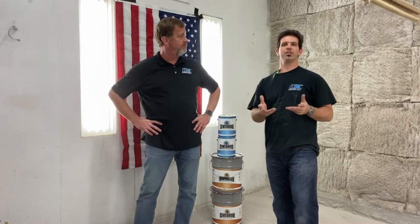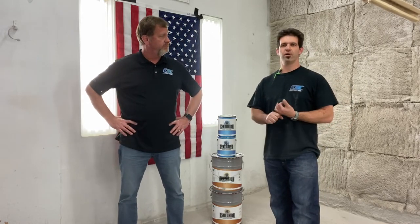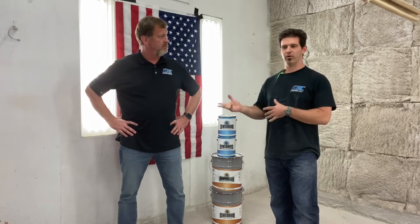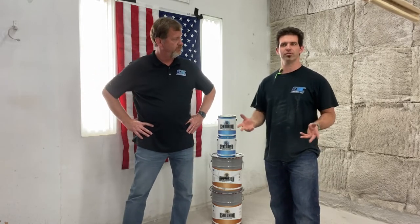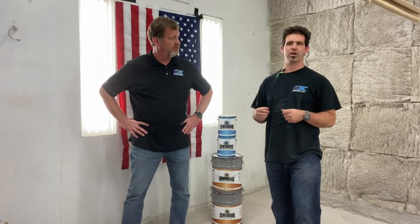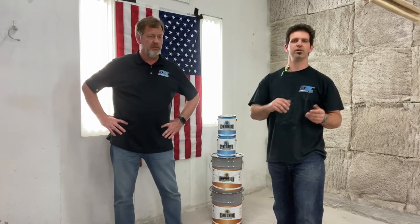Yeah, so a couple things I want to point out that we did today. We shot the CIC water-based conversion coating, and I'm going to be working with him going back and forth to see if we can get a little bit better vertical hang, because I know a lot of guys out there want to get that 4 to 5 wet mils, and then we're going to work on the shearing issues. And he actually sent me one before I got here, and I shot that and it came out really well, but we're going to try to push the needle a little bit more.